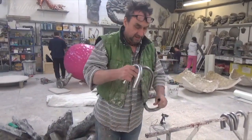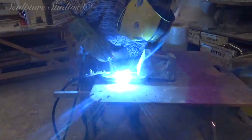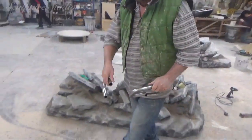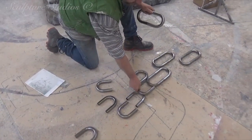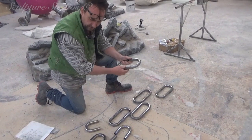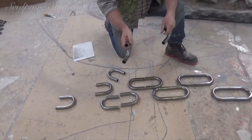Here we have some links we've had made up — three millimetres, mild steel, in a U-shape. We can weld them both together, get the next link in, and weld through the top section there. They have 1.4 metres long in length, and they all go over each other like this. Nice and chunky — we've got to artwork it up to make it look rusty, like the wrecking ball itself and the tees. It would have been miles too heavy if they were solid.